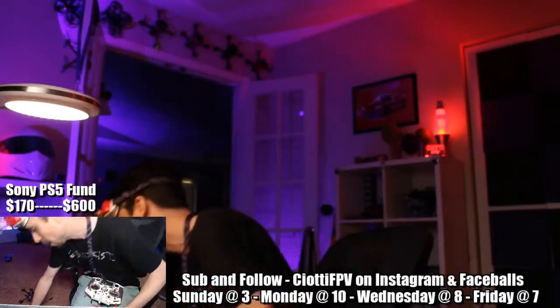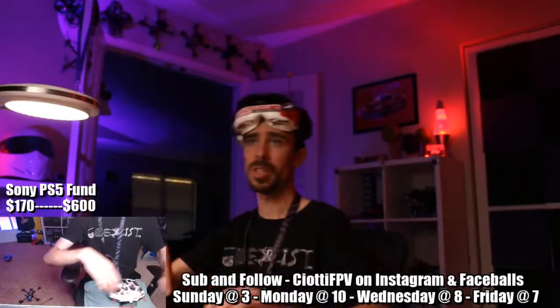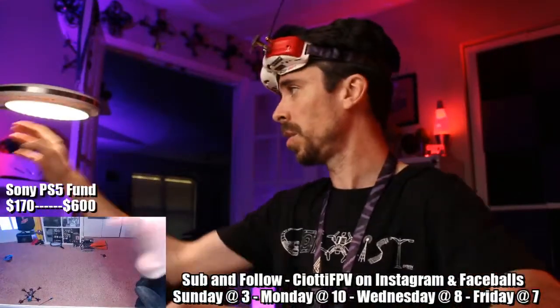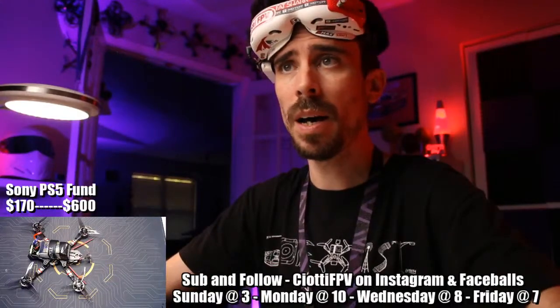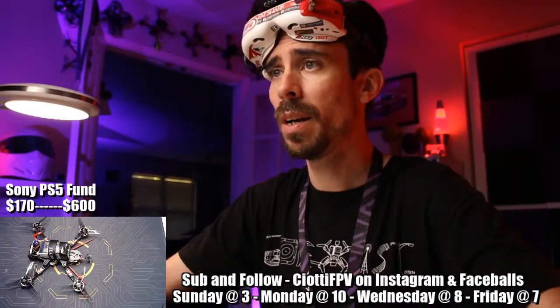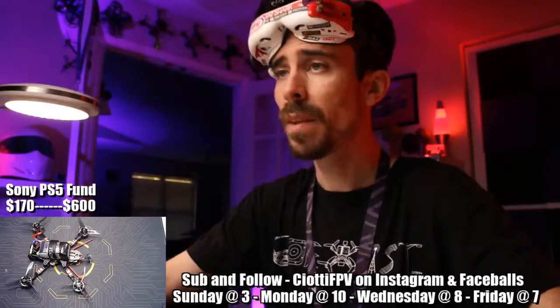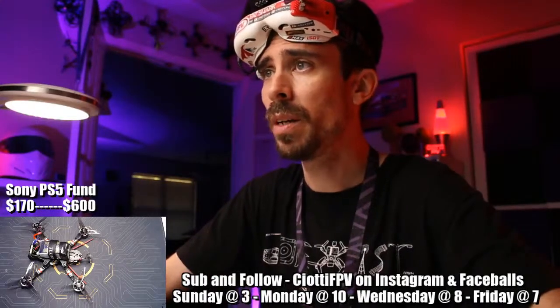I'm actually going to move the throttle limiting up. These props are a very low pitch, so they really like RPM. That 95% throttle scale is a little low, so we can move that up a little bit. But here's what a typical maiden looks like for me, in case you were wondering.